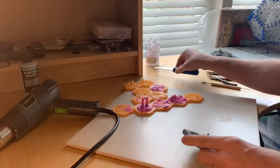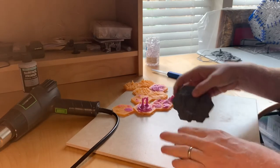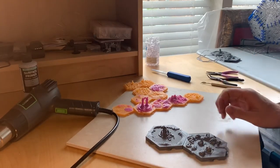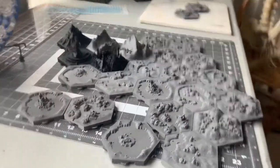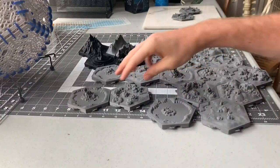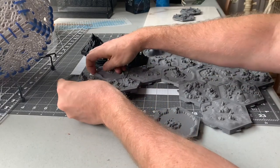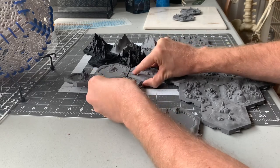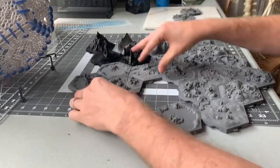Then the pieces will fit together pretty well, though sometimes they don't — and again, using the heat gun helps a lot. That knife to scour off the little bottom part helps too. I found that 150% pieces seem to work really well, giving a nice large-scale terrain. For print settings, 10% infill with only two or three walls instead of the usual four or five means they can print pretty fast. Just make sure to print everything at 150% so they all fit together.